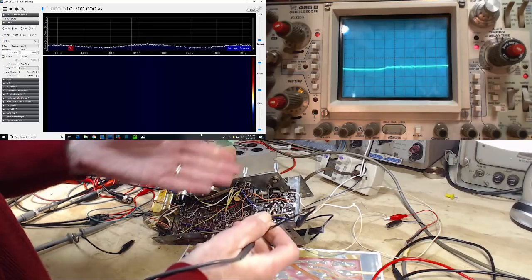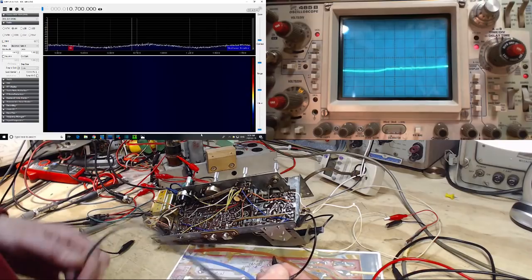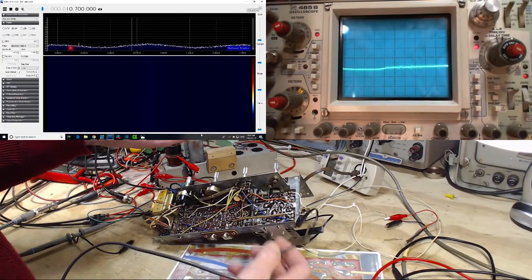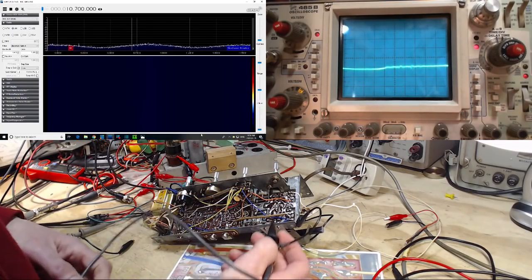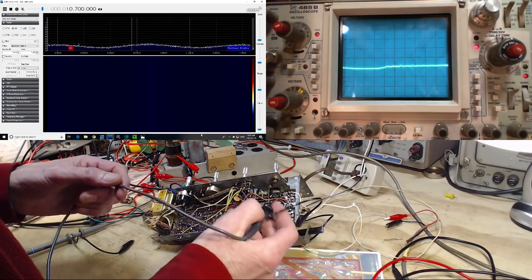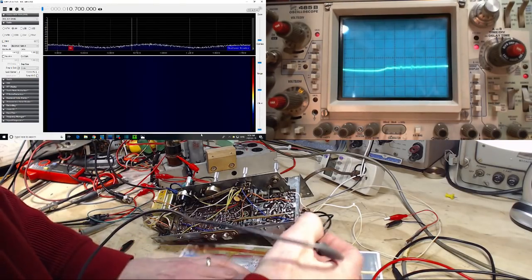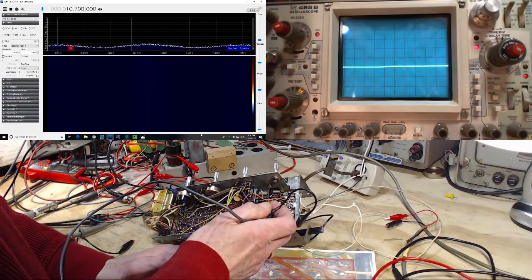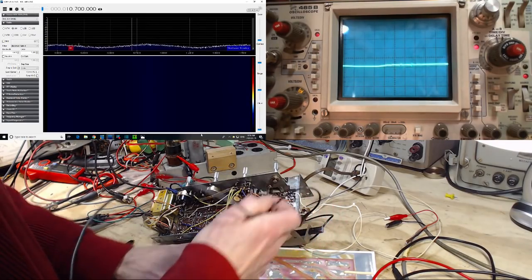Interesting. So we're going to jump further into the circuit now to the second transistor, which I believe is the one that's mixing the local oscillator and the incoming signal and producing the 10.7 IF signal. It's still an assumption on my part that it's 10.7, still a pretty good assumption, I think. So we'll look at the three terminals of the next transistor. We'll start with the base. This is what's on the base of the next transistor, and then the emitter.